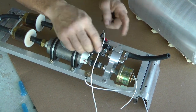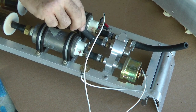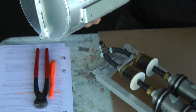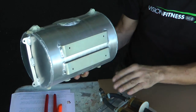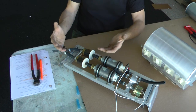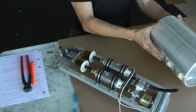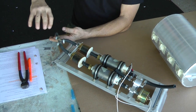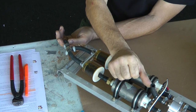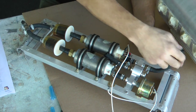We've pressurized the fuel and come out into an assembly that has a regulator, which then bleeds excess fuel back to either a header tank or directly to a large fuselage tank. If we have dual wing tanks and don't use a header tank, we need to select which tank we're taking fuel from and also select the same tank we're returning fuel back to, before feeding fuel to the engine.